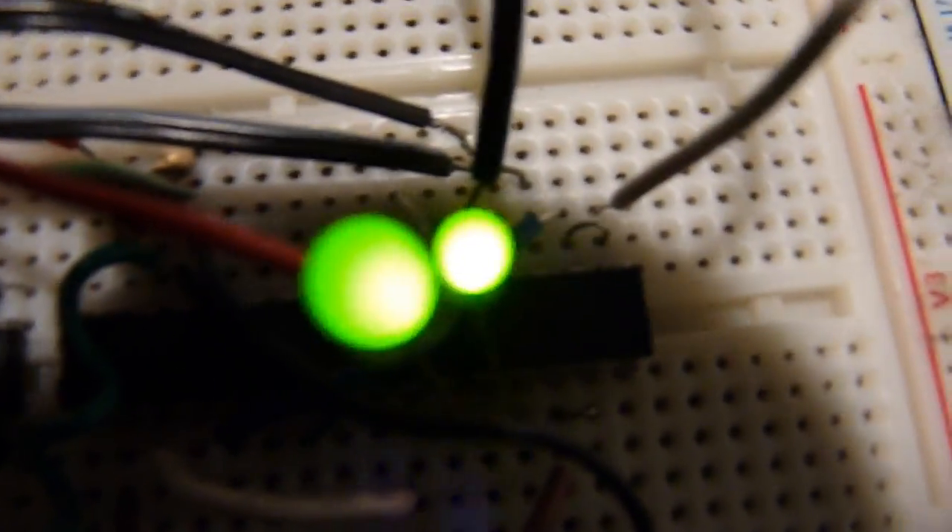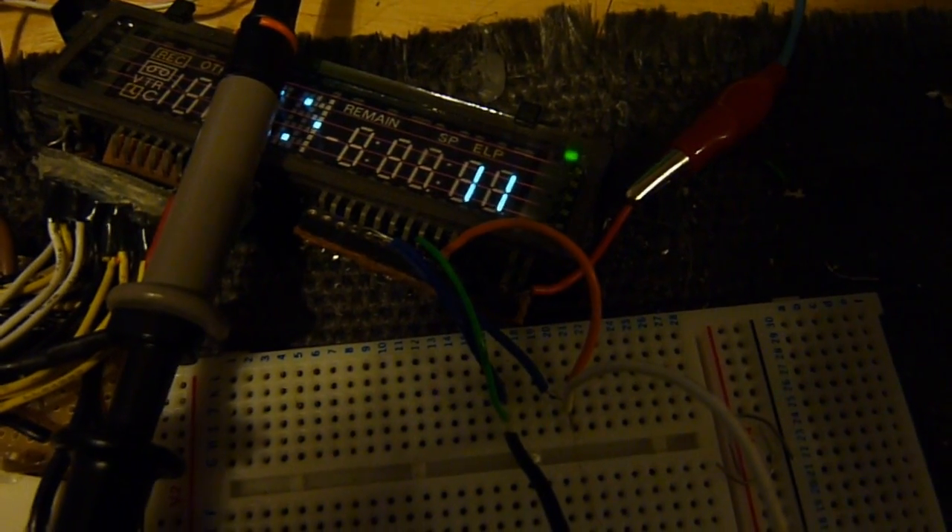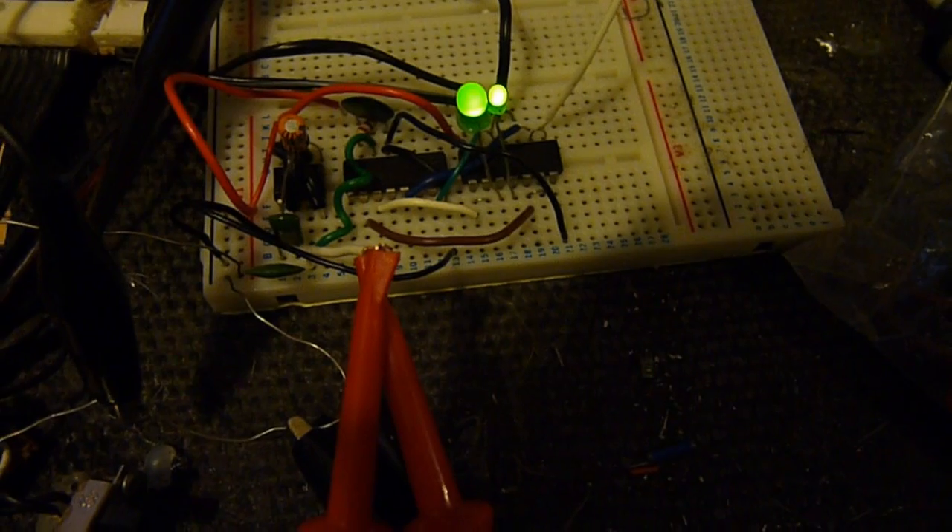So all this test equipment is very useful for knowing when stuff goes wrong. Let's give you one last look at it running. I should really put this up on my website. New update: multiplex. So this would be driver version 2; I'm on driver version 3 because I've removed the transistors. Success. We've now upped the voltage to 14 — that's an improvement. That is working a treat perfectly and it's just switched to 40. The driver is all tested and working absolutely perfectly. I don't think I'm going to use these original HCF 7-seg drivers — I'm not so sure I'm going to continue to use those.